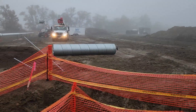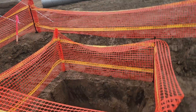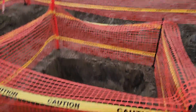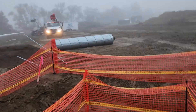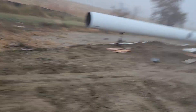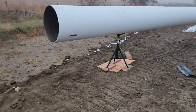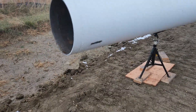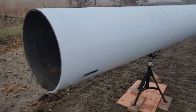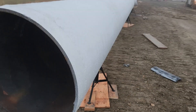That's a ground sleeve. It's 15 foot long, and it gets encapsulated in this hole. Then it's going to stick up two feet above the ground on a diamond pattern north-south-east-west. Surrounding that will be an 18-foot diameter cookie that has lights in it, and the cookie is upset — meaning 12 inches above the preceding height — like the center foundation.